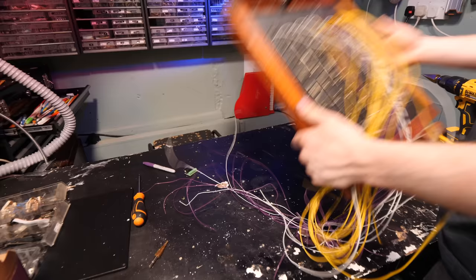So what happens is when you push one of these buttons here, it sends that wire to ground. The wire that has been connected to ground then travels through here, and depending which one it is, let's say it's this one, the electricity goes down here and then through all of the contact connections here that then travel up either the stop on or stop off wires that travel up here and into this Arduino, which then sends MIDI out to tell the console brain, which we made in the last video, to either turn the designated stops on or off. So you push the button, it goes through the preset and it turns on and off the designated stops that you need it to turn on and off, all via MIDI.